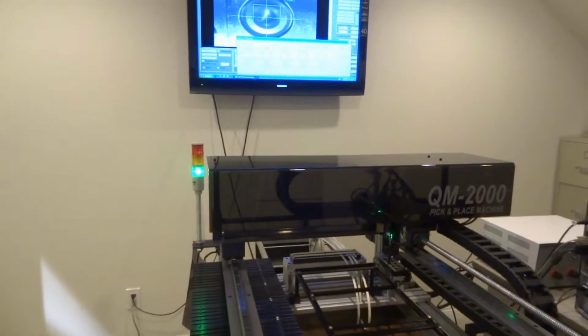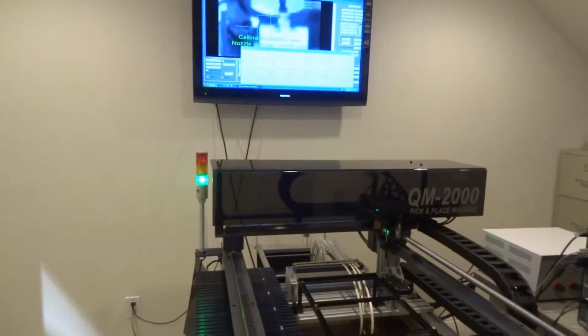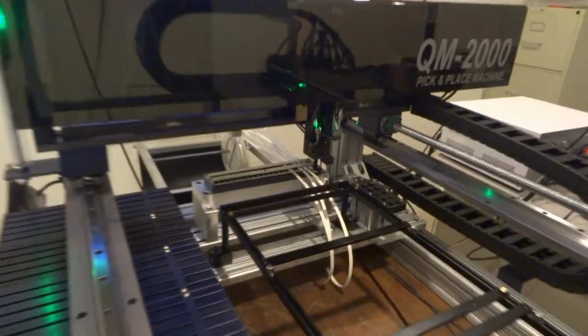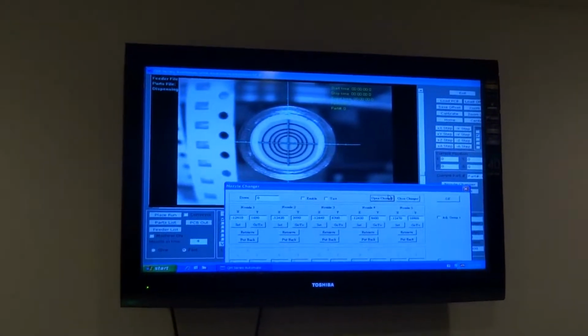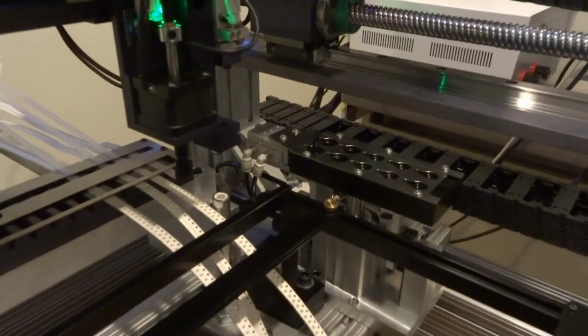The next step is to send the machine home. This step will close the nozzle changer. You will now open the nozzle changer window and open the nozzle changer. The next step is to insert all 5 nozzles inside of the nozzle changer.